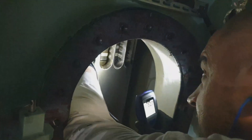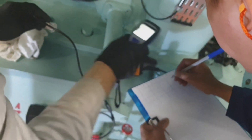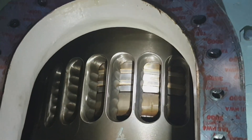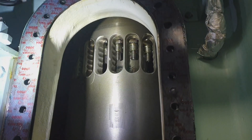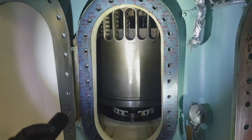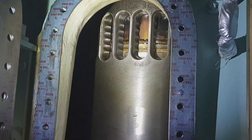Now we'll proceed to measuring the thickness of the piston ring coatings. This is how to check the piston ring conditions — just move the piston a little bit up and down and see the response of the piston rings. If the rings don't move, that means the piston ring is broken. From the scavenging ports you can also check the condition of the cylinder walls and the piston crown.